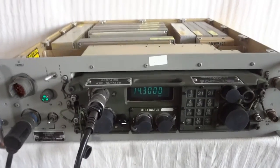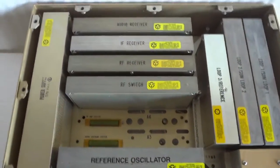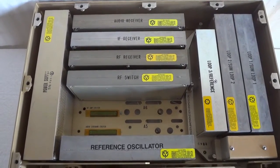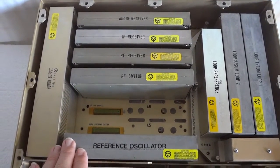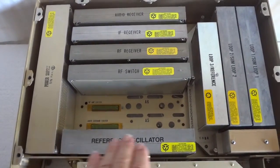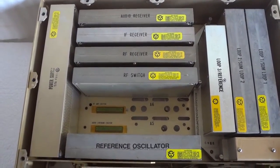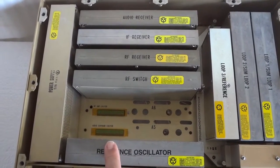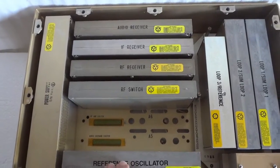Let's have a look at the inside. As you can see, the inside is built completely modular. We've got the power supply here. The power supply is 110 volt 50 hertz, nothing special. The reference oscillator is here — it's a 10 megahertz reference oscillator. It's also possible to use an external reference source of 10 megahertz; the unit is auto-sensing, so if you plug that in on the front, it will disable this reference oscillator. The receiver and the transmitter pad are completely separated. This is just a receiver, but the chassis is the same as the RT-1512 chassis, which has two more modules making it a receiver exciter. You can just take those out and it becomes a receiver, which is what they did for this particular unit.